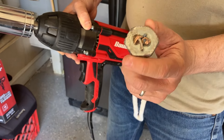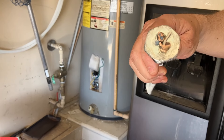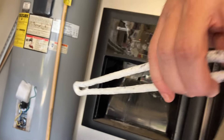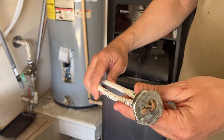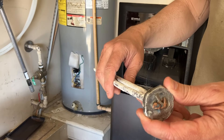Be careful — you don't want to damage this thing, I was close. Turns out there was lime in the bottom. I had so much lime that it was covering up to that element down there, so this whole piece was covered in lime. When I tried to turn it, it was just cemented in with lime.